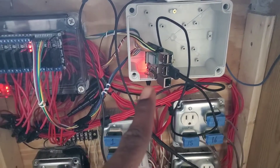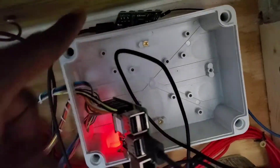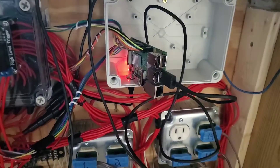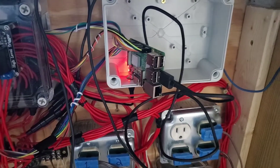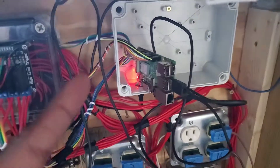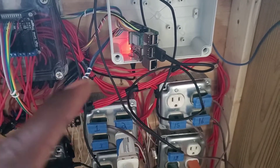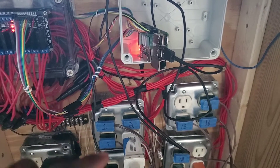Up here we have the Raspberry Pi, and somewhere in here is also the FM transmitter with its corresponding blue wire as the antenna. This year I used the FM transmitter plugged into a USB port so that it sends the data directly in via USB instead of using the audio out on the Raspberry Pi. In my opinion, there is a difference when you use USB audio out versus the audio jack on the Raspberry Pi to the FM transmitter. In Falcon Pi Player, when you connect it via USB, it shows up as a USB device and you are able to select that as an output.